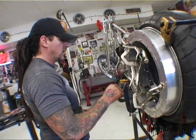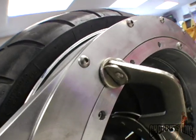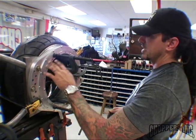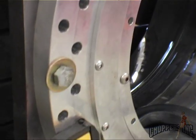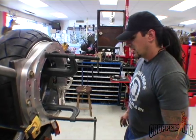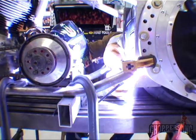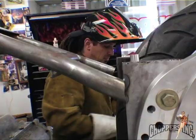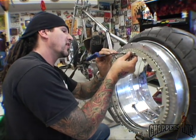What I'm lining up here is the inner bearing and the outer bearing race — I have to keep them square to each other. When I clamped the wheel down I forgot that the clamp was pulling them relative to each other, so I loosened it up, tightened these guys back up, and now I just have to tighten everything back down again. The key on these welds is getting good penetration into both pieces of material, because if I don't, it might look pretty on the surface but the weld is worthless.